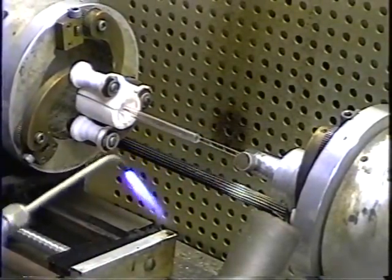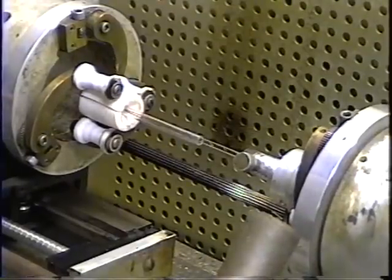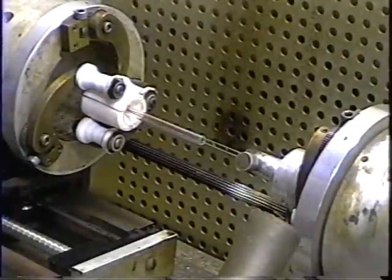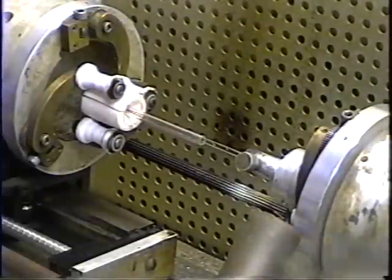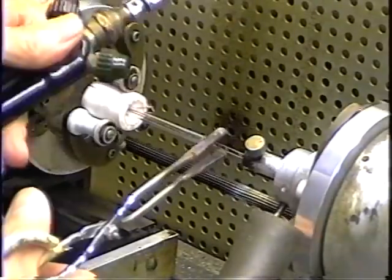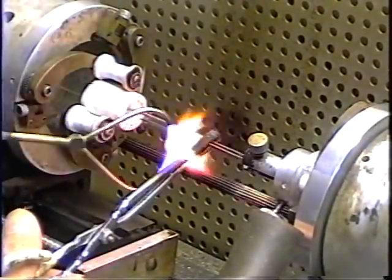That should do it. Now, moving the glass tubing up, I'm putting the nickel wires to where they're just inside the glass tubing so that when we heat them up, we'll just pinch it and grab them. Now, we're going to use the double-sided torch for going ahead and making the pinch with the masher so that I don't melt them when I'm heating the glass.